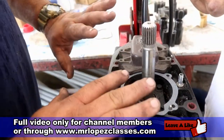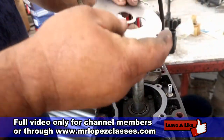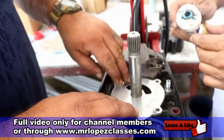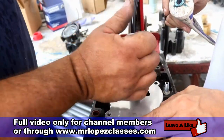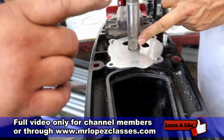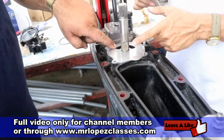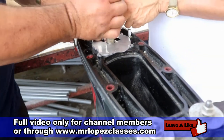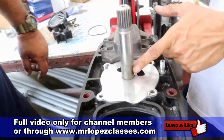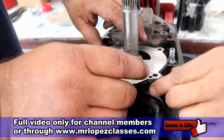You have a gasket — you don't need to put any sealant, just use the gasket as-is. Then you put the wear plate; if you need grease, we have grease over there. I normally try to have the keyway pointing this way, and the reason is: if you drop it, the keyway doesn't accidentally fall out. This is a great tip — facing forward to avoid dropping the key into a hole where you can't retrieve it, which means taking everything back apart.